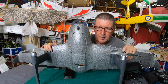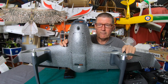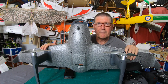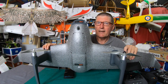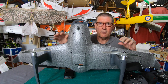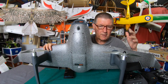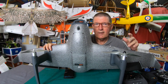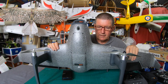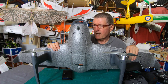I also had another problem where I couldn't switch to wing mode — I could hover in VTOL mode, but it wouldn't switch to wing mode. I think that was after a firmware update that didn't apply properly, so I just redid it and from then on it's been behaving normally. So: make sure you've got the latest version of HEQ on your phone, and hopefully all new versions come with the updated firmware.